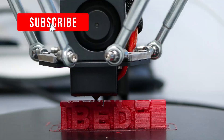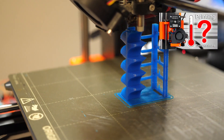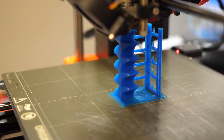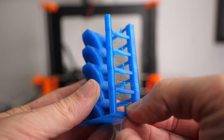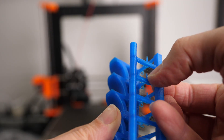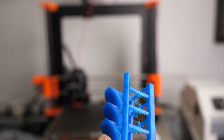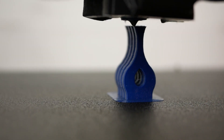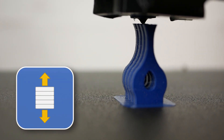If you enjoy these investigations, make sure to subscribe and select the notification bell! Because I have already done some investigations in the past on this topic, I knew that usually at higher temperatures, layers fuse together better. What I tend to do on 3D Maker Noob's temperature tower, which is the one I usually use, is I break the spikes with my finger to get a feeling if some are harder to break than others. Besides that very rough method of testing, I wanted to properly find out if printing hotter always means better layer adhesion or if at some point we run into material degeneration and therefore make the print weaker. To test that, I printed quite a lot of my mini tensile test specimens in their standing orientation, because that lets us later judge layer adhesion.